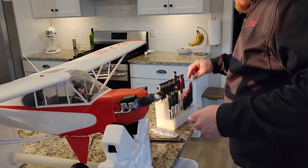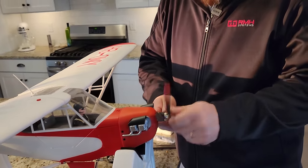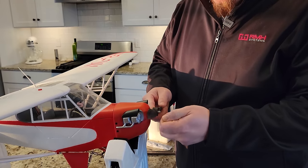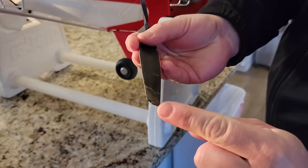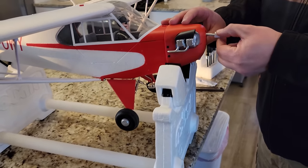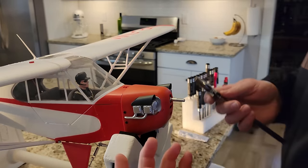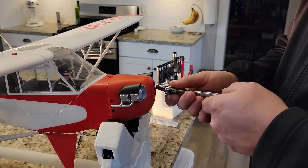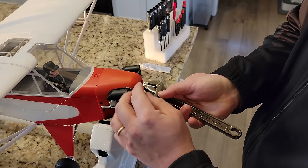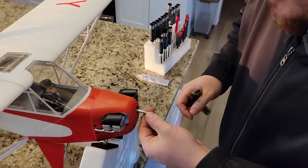That bend is not okay. I'm going to take a screwdriver — a 1.5 millimeter — put that in there, break the nut free, and pull this off to see how this motor mount goes together. We do have a little bit of a disparity — you see that snapped-off part? There'll be a little bit of a balance issue, but this is just a standoff. You can see right there how it bent. We got lucky. Normally I wouldn't suggest you do this — just replace the broken component — but I'm in a hurry, and you guys are going to do the same thing anyway.